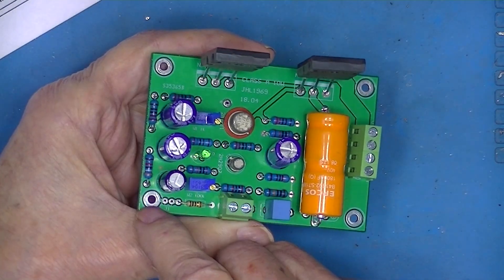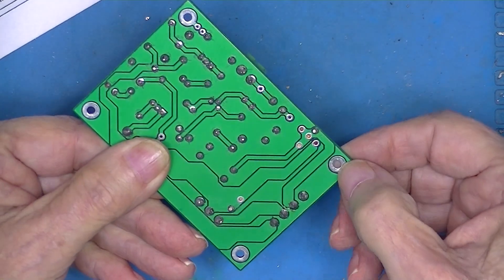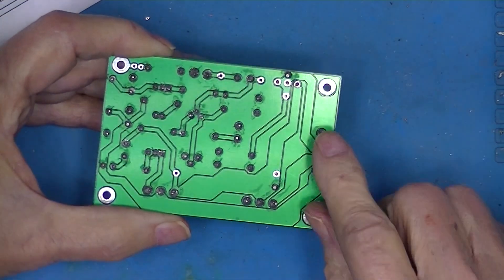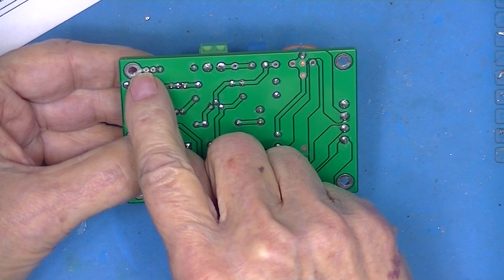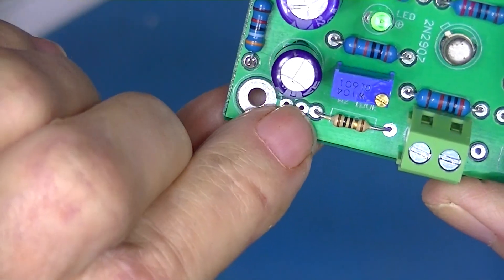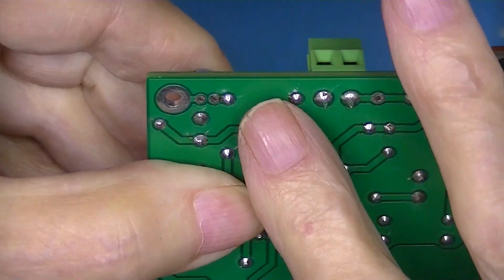Another unique thing about this board is that all four mounting holes are surrounded by a plated area on both top and bottom. These plated areas are not electrically connected to the board, so any mounting screws connected to a metal enclosure are isolated from the board — unless you use the jumper called J1 at those two unpopulated holes.